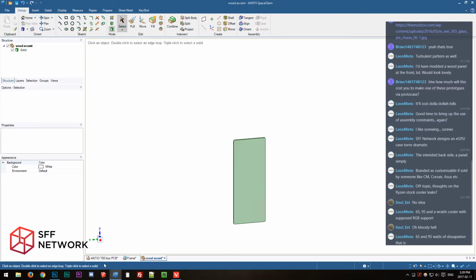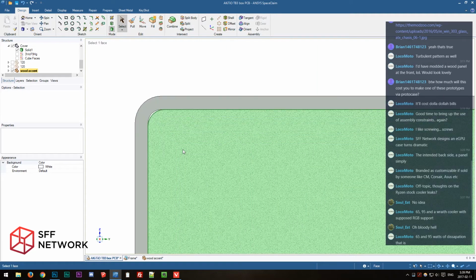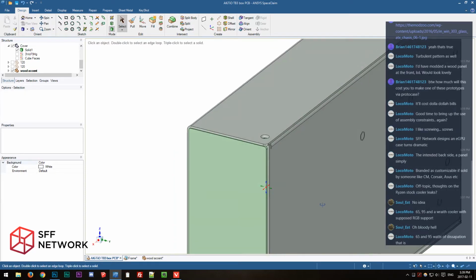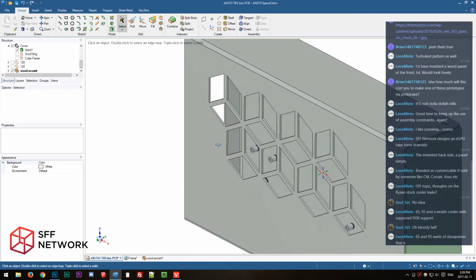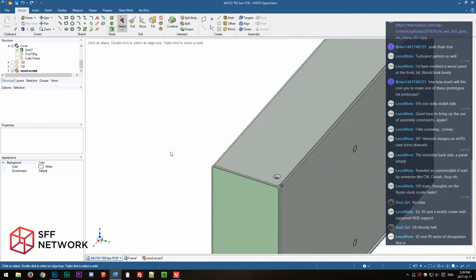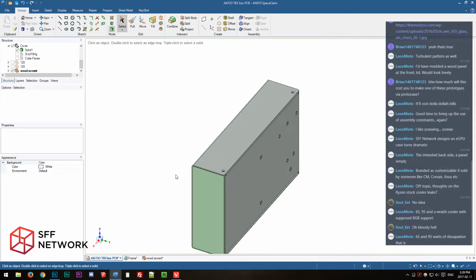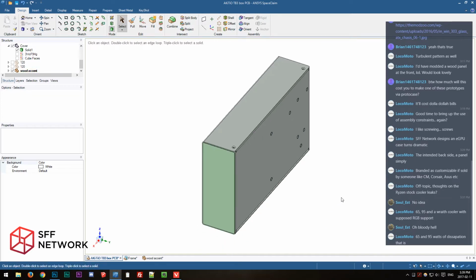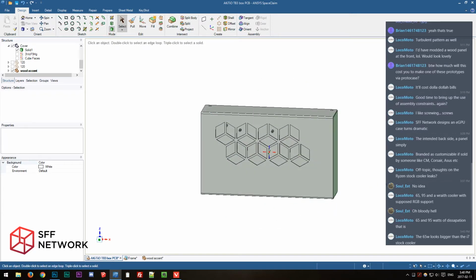Oh, the 65 watt TDP thing. Yeah, we'll see about that. I'm a little skeptical. I mean, it is a little bit easier than Intel since they don't have integrated graphics, because part of the problem with the Intels is that they have those integrated graphics they have to account for. So they can only make the TDP so low, because the TDP has to account for what would happen if both the CPU and GPU are under load. So Ryzen doesn't have that problem, since at least the processors that will originally release will not have integrated graphics. So that helps, but we'll see.